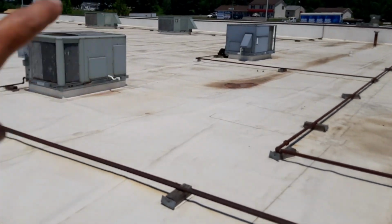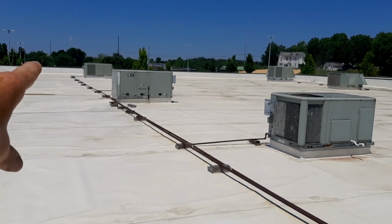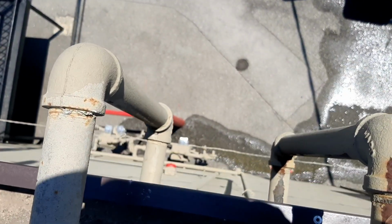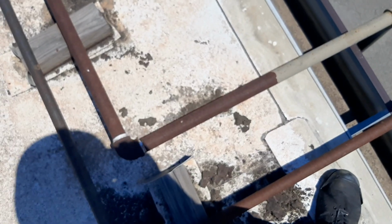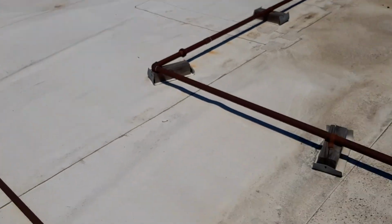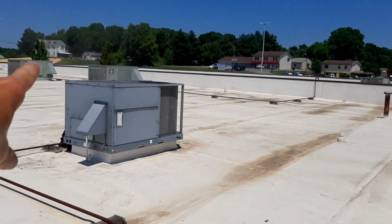So quick tip here, I'm trying to figure out which units do what. Pretty sure I did a video on that front unit. It's for another office area. Did that years ago. I didn't know about these two, but I can follow in little strip malls like this. I got two gas meters down there. This line is feeding and it should separate, barring any additions or things getting changed around. This should be the only units for this space fed on this gas line here. We can see these are two different gas lines feeding up to those three there. So these two aren't theirs. And then our gas line here feeds the unit we're working on, that unit over there, and then these three.